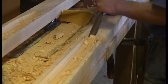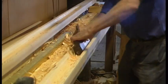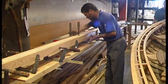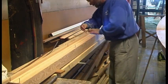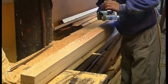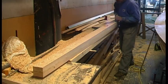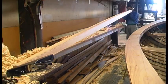The ends of the hollow sections are tapered. The hollow is then cleaned up with a round-soled plane and sealed with varnish or epoxy resin. The two halves are then glued up. Once the glue is dry, the taper in the other dimension is marked, cut and planed, starting with the power plane and finishing as always with the hand plane. It's important that the spar is square all the way along and that it is fair — that is, with no bumps or hollows. Sighting from each end is the best way to check this.